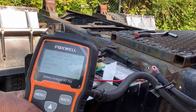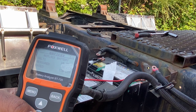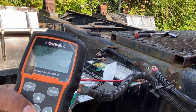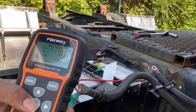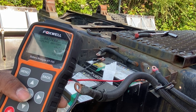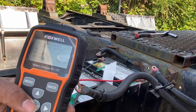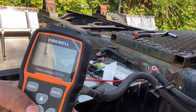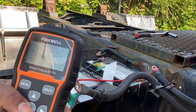Just as we should expect in a parallel system, if one battery is bad, normally the rest of them are going to be bad as well. Sometimes with three or four batteries you might still find one or two good or marginally good ones. But as a general rule of thumb, if you have one bad battery in a parallel system, you want to go ahead and replace all the batteries. A lot of people try to replace just one or two — it's normally not a good idea.